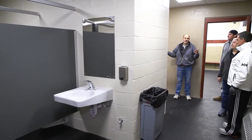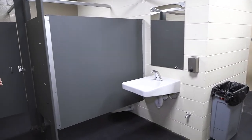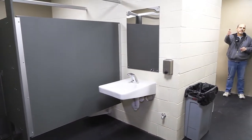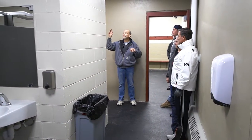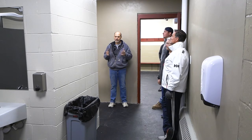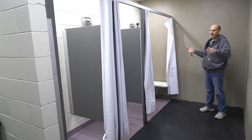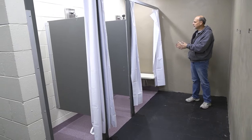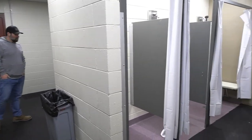We're in one of two renovated shower rooms. Each shower room handles two locker rooms. There's radiation here through a room-sensing thermostat and it's tied to the energy recovery unit on the roof, with ceiling grills for supply and return HVAC. These rooms were made fully handicap accessible — two general-purpose shower stalls and one fully handicap-accessible shower stall, as required by current building codes. This is typical of both shower rooms installed.